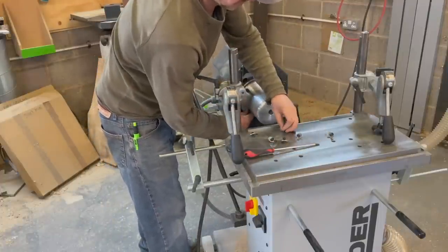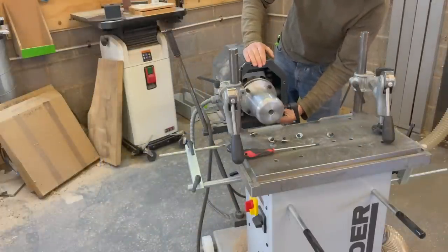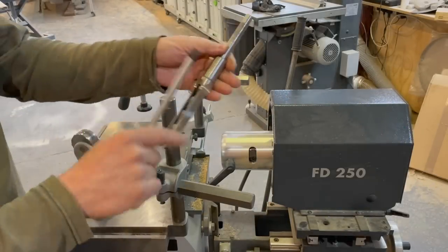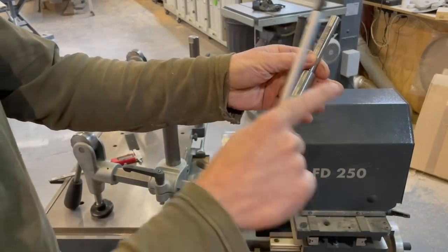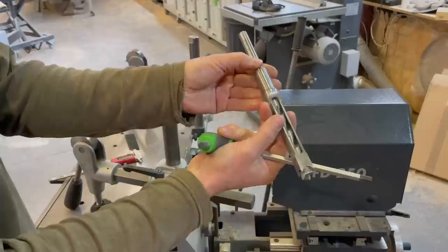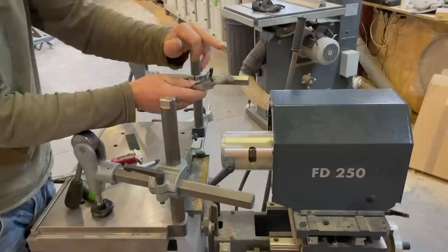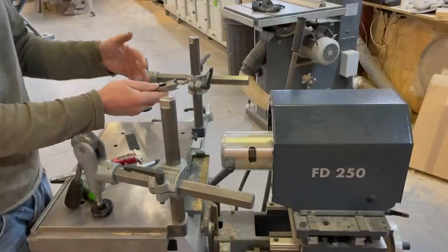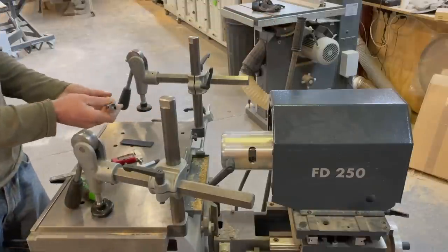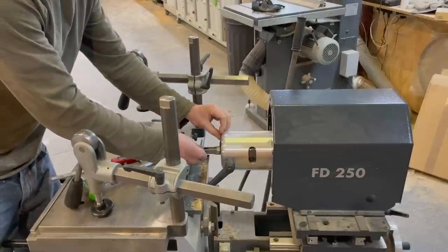It takes about five minutes to change over, so it's not the quickest but it isn't that bad. This shroud holds the chisel and handles the left and right movement, stopping any pressure on the chuck. The chuck holds the cutter — in this case a 16mm cutter. What you want is for the drill bit to lead the hollow chisel by about 2mm; I have a 2mm spacer here. We simply insert the cutter, put our spacer in, and push it back.